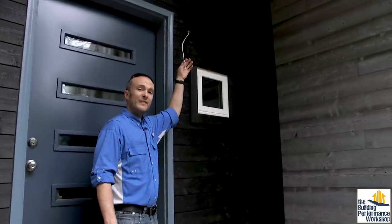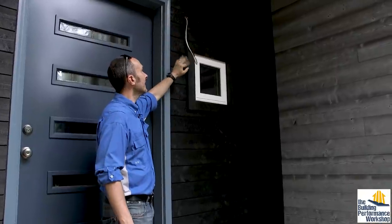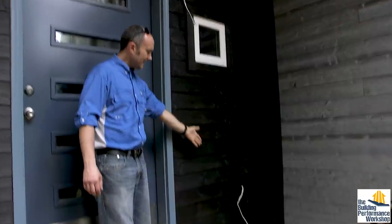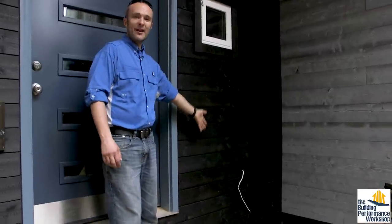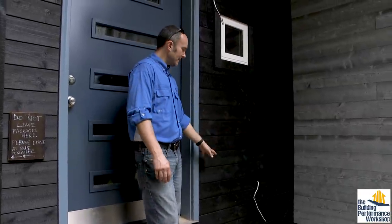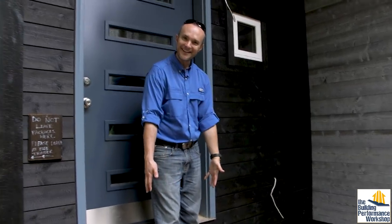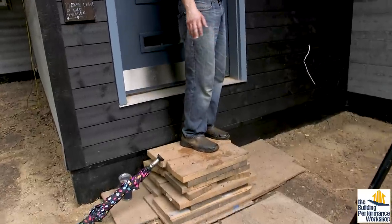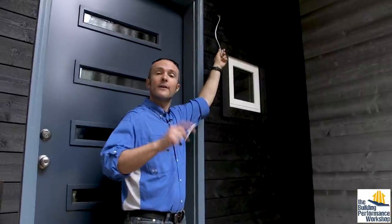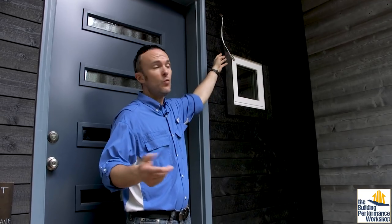As we go inside, you'll see we've got these wires that are just left outside — sometimes they're pigtailed to look a little nicer — but these are where we're going to attach a light here and an outdoor outlet. You're going to need an outdoor outlet every time you've got a door going outside, and it needs to be within a certain amount of space. That one we can hide behind a shrub or whatever. This is our front porch, and this is our step that is not going to be here in the final version, but where to put these is an important decision. If you're not there or don't see exactly where this goes, the electrician is going to have to just make something up and it might not be where you want.